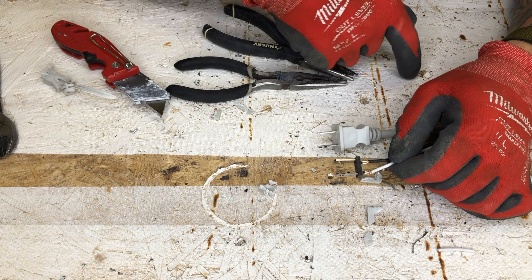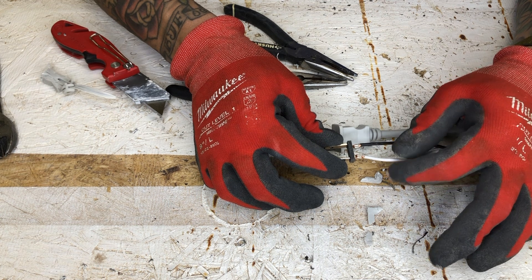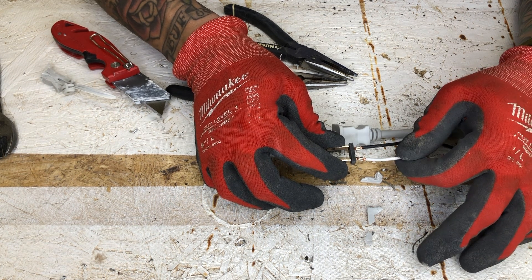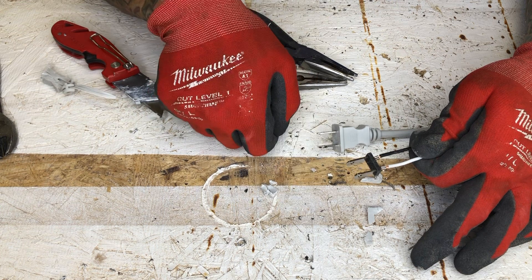That's why it's okay to cut these plugs off and take your black and your white wire — your hot wire and your neutral wire — and hard wire them into your walls or a fixture in the ceiling. It's the same thing going on right here, except they just make it so that you can put it into your plug.